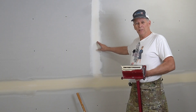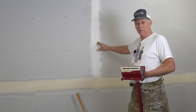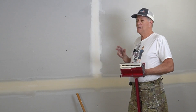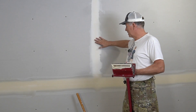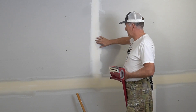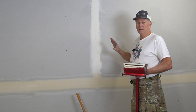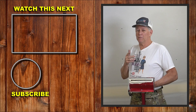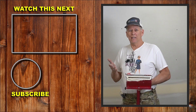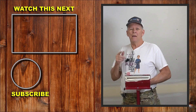As for the butt joints, I'm going to do a separate video on that. Yes, you can box the butt joints — that's just kind of what we call it, boxing them — you can coat them with the mud box. But I'm going to go up to a 12-inch because butt joints, unless they've done it with butt boards that recess it, are going to have a hump, and if there's a hump we need to coat it wider. We might split it and even triple it depending on what they need. I hope this video helped — ask questions in the comments, and I'd appreciate a thumbs up, a subscription, and don't forget to click the bell icon. Take care everybody.